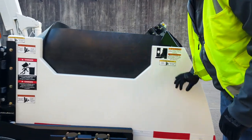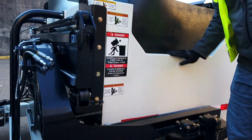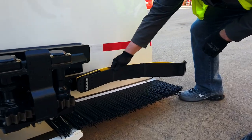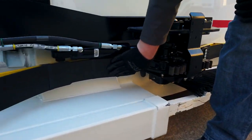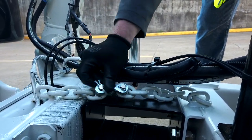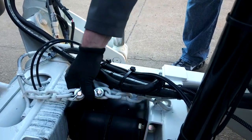Overall structural integrity, no damage to the container, arm or slide. No oil leaks from the hydraulic components. Gripper belts are without tears and no extensive wear. Safety pins and safety chains are in place without damage and working properly. Check that the container is securely mounted to the forks.